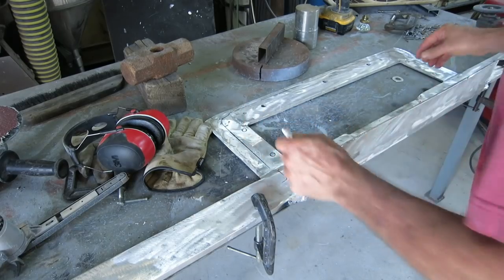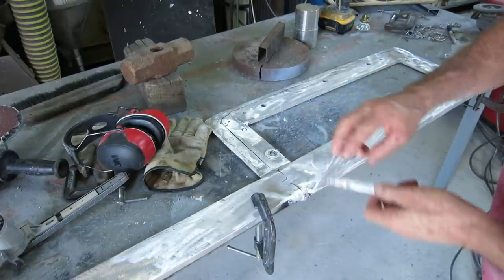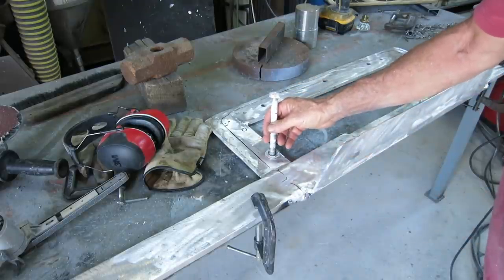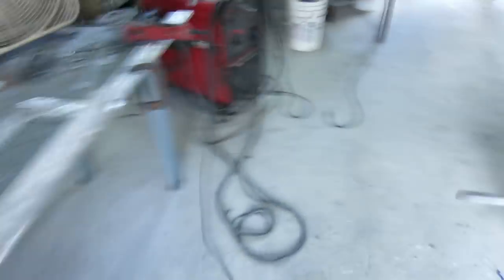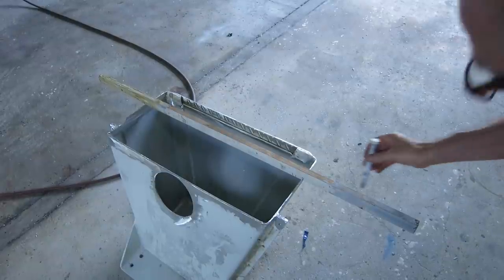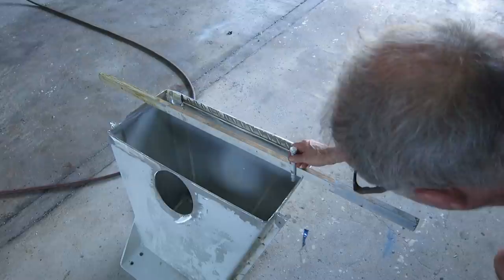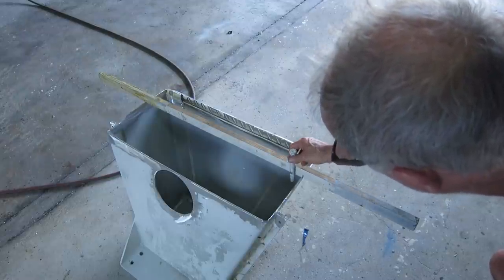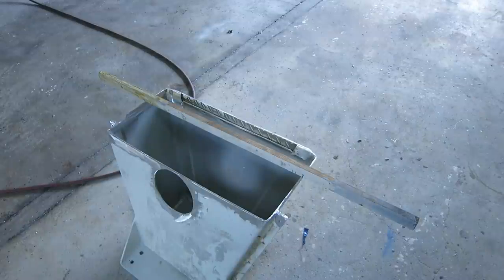These are my new locations for the holes — I left room for a full washer. I did a marking stick and brought it over here. If I hadn't moved them, the bolt would have been right here, but just moving them in a little bit gives me a couple inches of bolt sticking out the back where I've got room for my wrench and room for a nut and washer without being in a bind. That's why I moved that outside row of holes in a bit — probably about an inch.